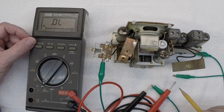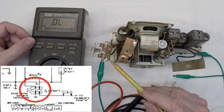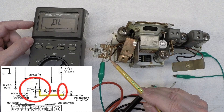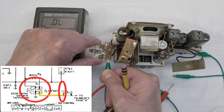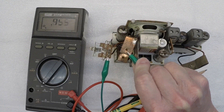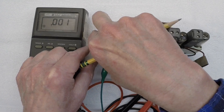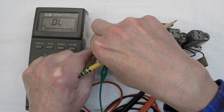Let's move over to the type A connection now, which I'm highlighting in the picture-in-picture. If you follow that back, you'll see it attaches to the negative side of the type A battery, which is the 1.5 volt battery. Let's move the jumper and check there. This side of the battery is positive, this is negative, so we'll attach here for the type A battery. You can hear we have continuity with the switch on. Let's flip this off — and you can see it breaks continuity. That's what should occur.